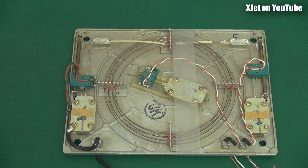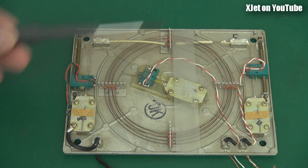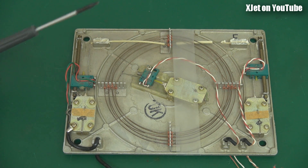We've got one transmitter and two sensors. Why have two sensors? I'm pretty much guessing on this because there's not a lot of information on these things, but I think that because we run out of wire here, if we don't sense what's coming along and re-inject it, we're going to lose our memory — we'd only get one cycle. If you wanted to store data in this coil for any length of time, as it gets to the end you've got to push it back into the beginning. So there's a sense here, it's amplified and fed back in, so the data gets recycled. It's a dynamic memory that requires constant refreshing — some of the early RAM chips work a bit like this.